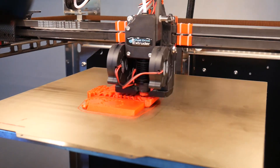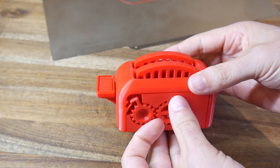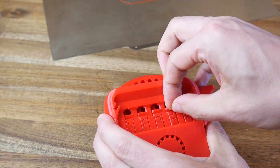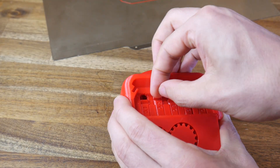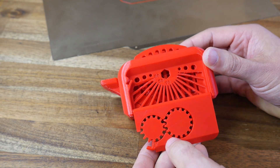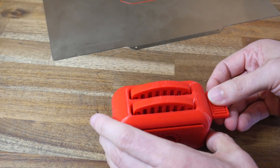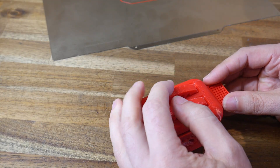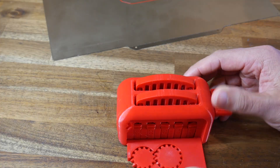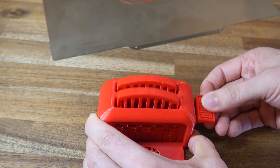This one I printed from PLA on the second SK tank. It completed on the first go, but that doesn't mean at all that it's an easy print. Both of the sides hinge up and down — pass there. On one side, we have these clearance segments, and the idea is to see if they are free to move up and down. They get tighter from right to left, and on this print I was able to move them all the way down to 0.2mm, but my tightest 0.1mm segment remained fused. Each side has a geared locking mechanism — both sides worked great for me — but we can see on the overhang test my result is far from perfect, particularly on those mega steep 80 degree overhangs. The final test is to push the lever and see if the toast will pop, and mine only partially lifts up. This torture toaster did print on the first attempt, but there's plenty of room for improvement, and it would be a suitable tool to experiment with printer and slicer settings until you got everything perfect. Independent of that, it makes a satisfying fidget toy.